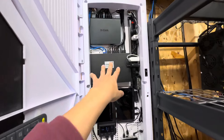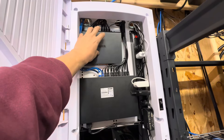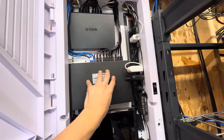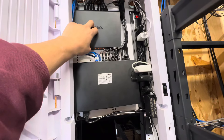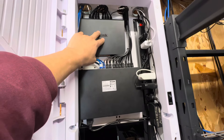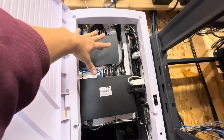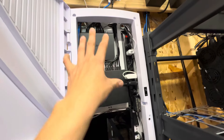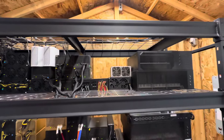What we're going to have to do this weekend is expand our networking. We've got a 24-port here and a 16-port here that's completely filled — we've only got two ports available. Since he sent us four units, we have to upgrade this unit. We're going to change this into a 24-port, basically replicating what we have up here, which gives us an additional eight ports. Minus his four, that leaves us four extra ports.